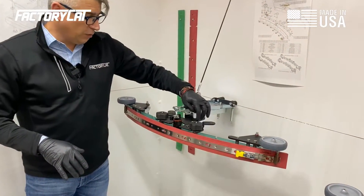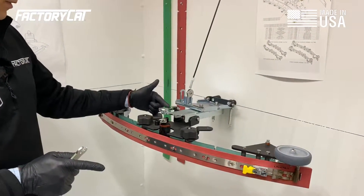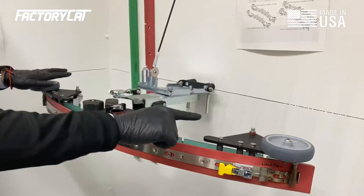Each machine is equipped with its own built-in wrench, and there are three points you need to adjust on this squeegee. There's the turnbuckle here, which adjusts the pitch of the squeegee, and then you have your left and right casters, which control your ride height.